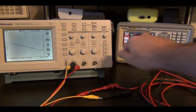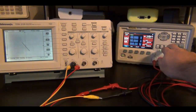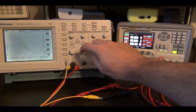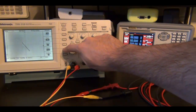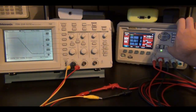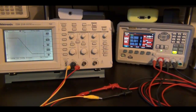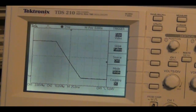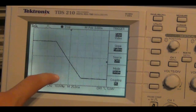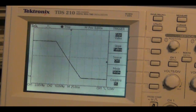Turning it off — you can see it takes longer than a division. Enabling the output and single trigger, then off. Under no load, the curve is completely linear. It goes from 10 volts to 0 volts in about 3.5 divisions — approximately 60 milliseconds to go from 10 volts to 0. That's expected since there is nothing to discharge the output nodes of the power supply.